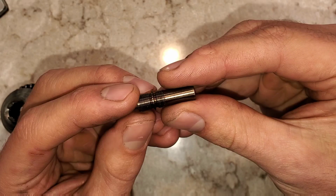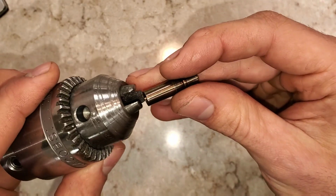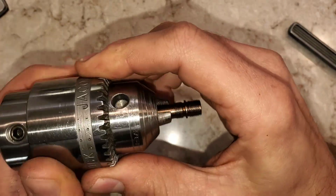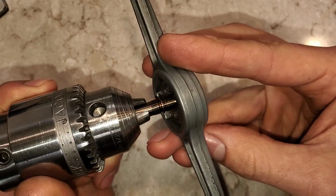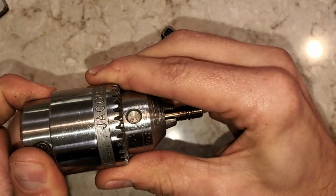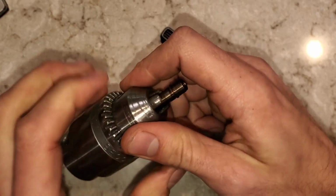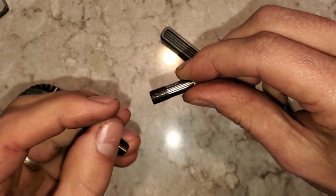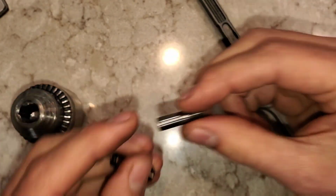This thread coupler is made out of titanium. It doesn't work though because when I flipped it around to hold it, I ended up crushing it. I held it in this 3-jaw chuck. When you tighten this down, I added too much force. I need force because this is the tool I use to add the threads. Come from this direction and add the threads. This die goes over the top. It takes a lot of force, so that means I need to crank down on this to hold it. The titanium's strong, but it wasn't strong enough to withstand this process. So it's hard to make, a lot harder than this one. So I could just hold it back here and thread all the way over the top. I didn't need to worry about flipping around and holding it by this thin part.